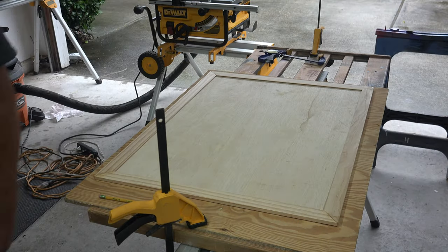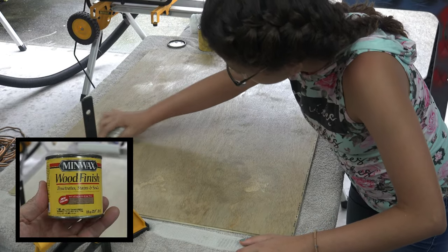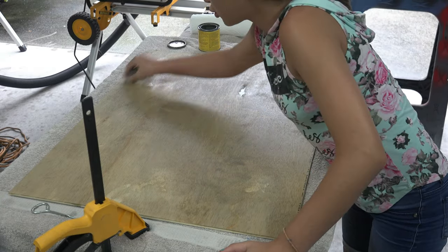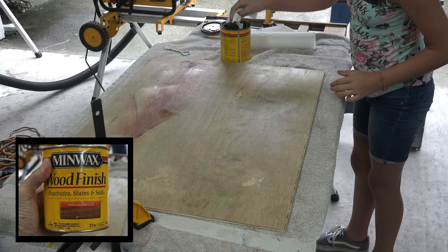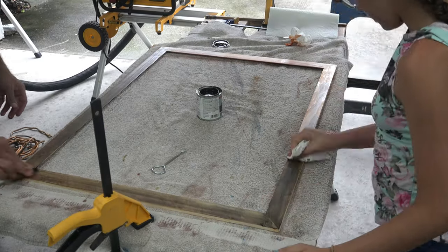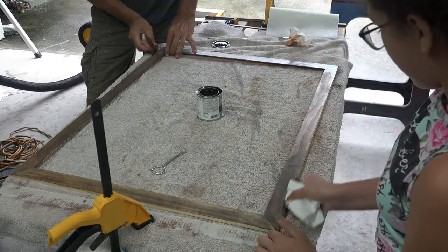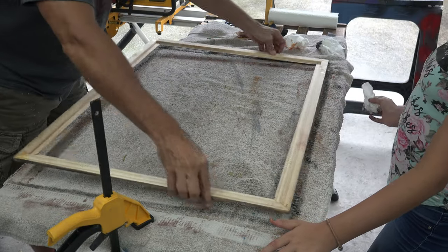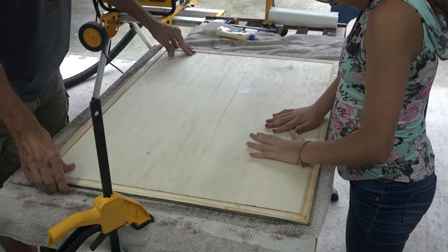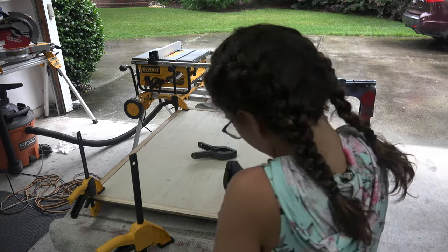This frame is supposed to look a little old, so just a quick sand on the corners to make sure your joints are level. With a Minwax weathered stain, we hit the backboard to give it that aged look. Birch does not take stain well, so if you have to mix and match to get the right tone, don't be afraid to try a few colors. For the outer frame, we reverse the order by putting down a dark stain first, then added a charred stain that gives the wood an old fence-looking color. With the stain complete, we glue in our backboard — place a bead of wood glue around the lip, lay in your back plate, and add a few clamps to ensure no gaps.